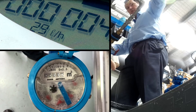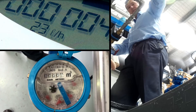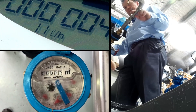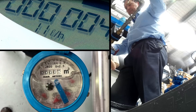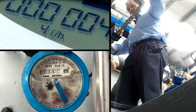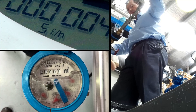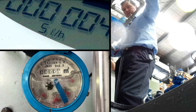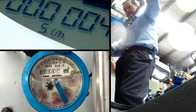So that's the difference — we're going from a stream flow for the bar meter back to a drip for the iPearl. We're still recording now on a drip. The iPearl will come down in its readings to about five, and the bar water meter has now stopped recording. This is ideal for leak detection — the iPearl is still recording at five, and we can go even lower.